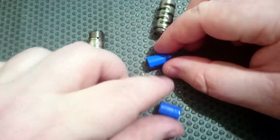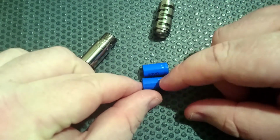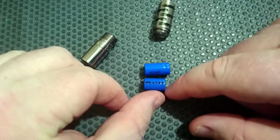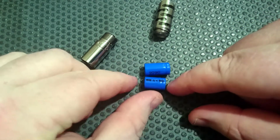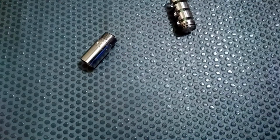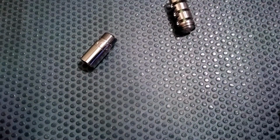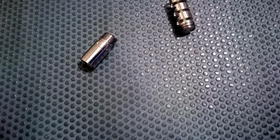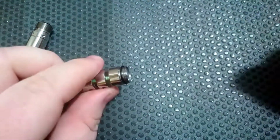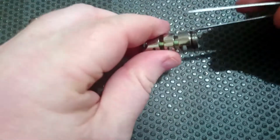This is a 10180 cell here from the QU, and this is the 10150 in the Helius Sigma. So not too much difference, but you can see that the Helius Sigma does use a much smaller battery compared to the other micro keychain flashlights. We'll move them both out of the way. Both still lithium ion technology, 3.6 volt cells, 3.7 volts, so 4.2 volts fully charged. You can actually take out the tritium in this one, which I will show you.